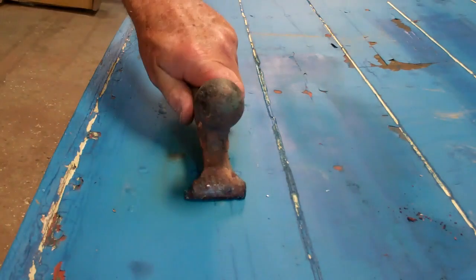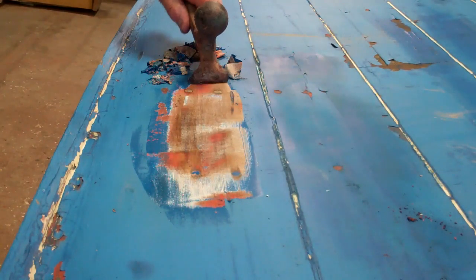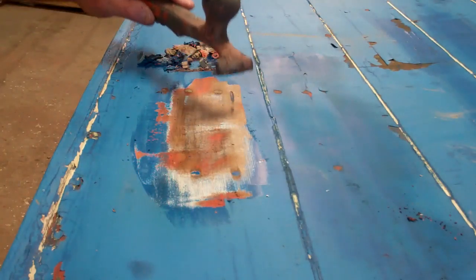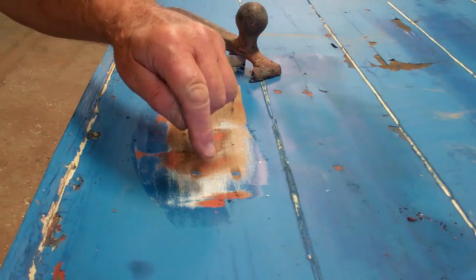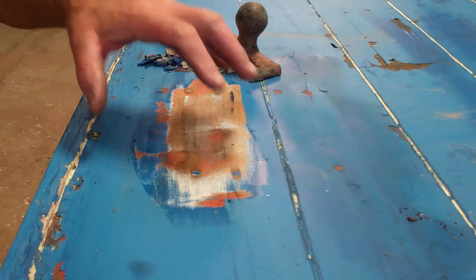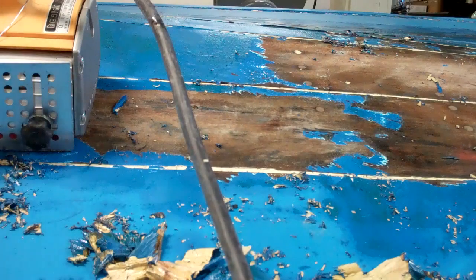Here the paint is sound. What I can take off — I'm getting all the way down to the wood in a few places, but here I can clearly see a primer, an older bottom coat, and the most recent bottom anti-fouling paint. So this paint has still adhered to the wood. Whereas up here, even though it's all cooled off, you see no evidence of multiple layers because none of it is adhered to the wood any longer — that's telling me here's planking that cannot hold paint.